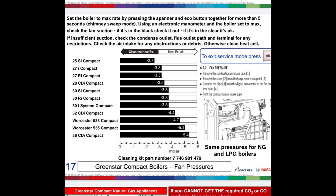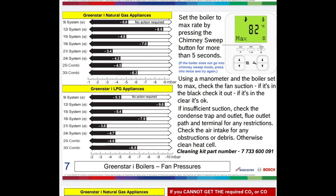Assuming that's okay, you want to be doing your working pressure — again you should be doing that anyway. Then check your flues — make sure there are no obstructions on the outside on the terminal. There's a clip here where I cover the terminal partially with a spirit level and it just shows how it can affect your readings.